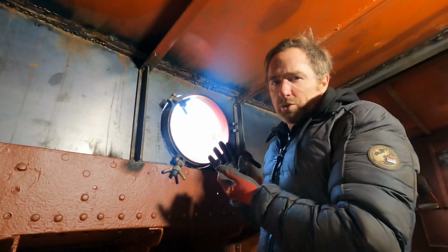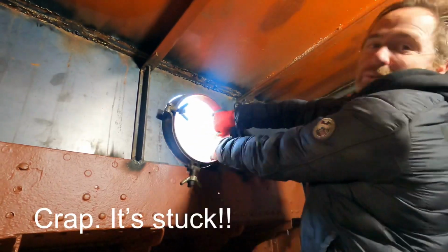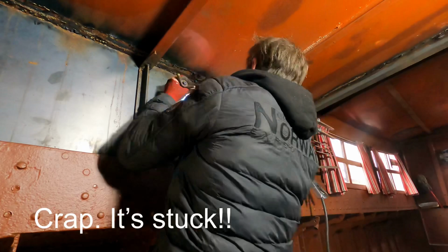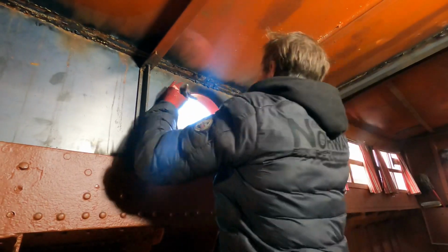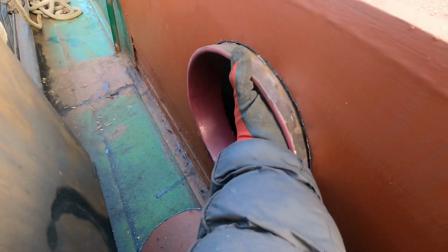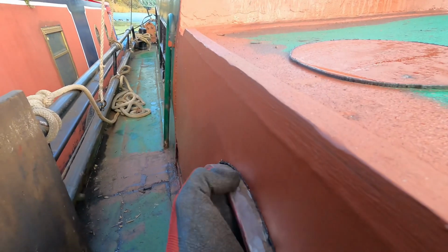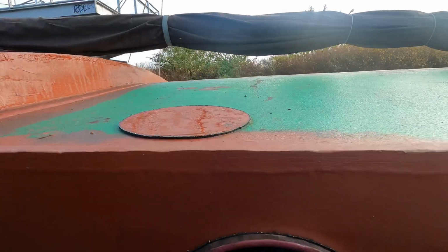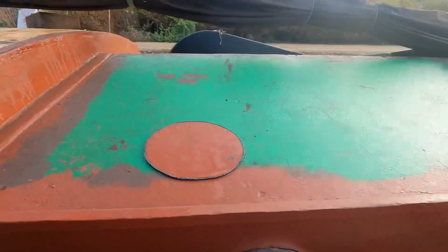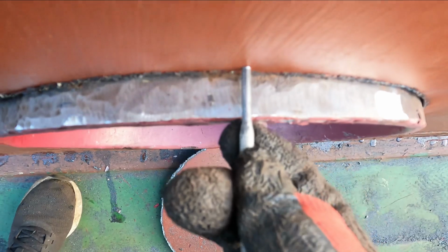I cut a hole with a plasma torch, and then I have to grind the hole to make it bigger so this can fit through. I need to arrange it in such a way that it is sort of an angle like that, so that it's similar to the other 2. Of course, I'll measure that bit at the top. So I will play with that, and then I will settle it and spot weld it. A delicate tap. To the end.